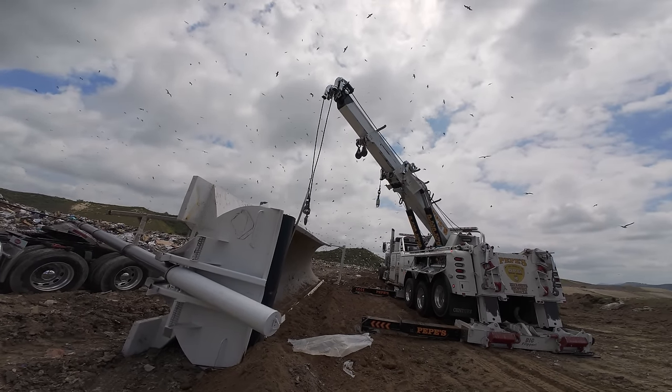Yeah, I'm just applying pressure to it. So it's actually not that much pressure. It doesn't take that much pressure to suck in that thing. Once we have the PTO on, it pretty much opens up the check valves and retracts it. Virtually just applying a slight pressure.